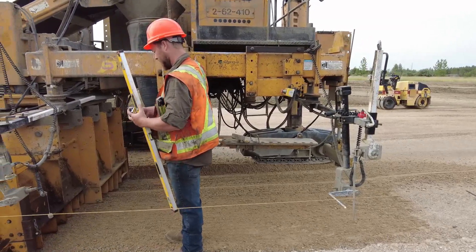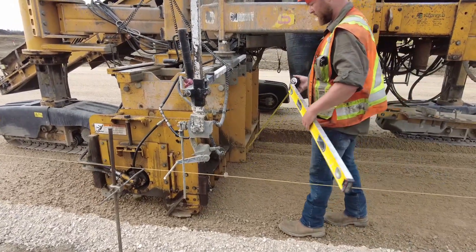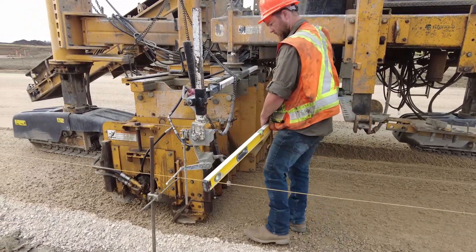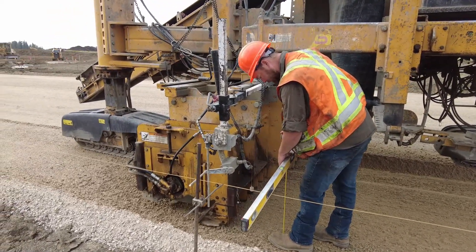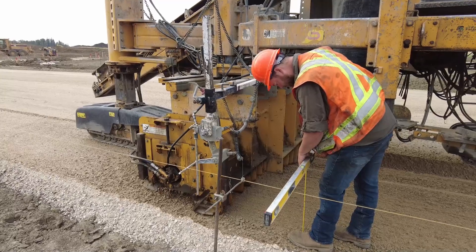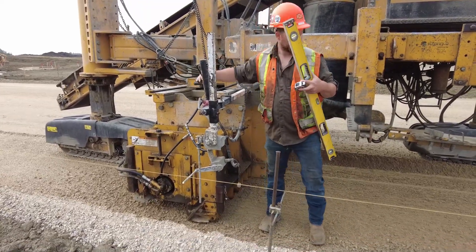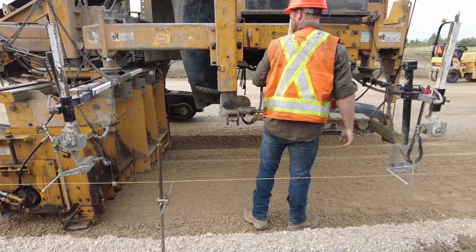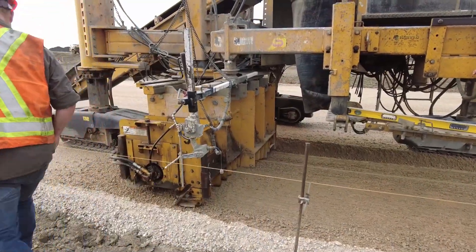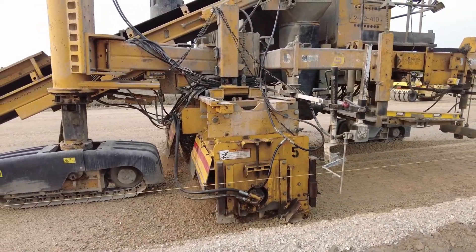That was the voice of Haley Hall. Haley kindly shot this footage for me. Here is another Gomaco operator, Kyle. Kyle is checking off the string just to make sure that everything's on grade. The Gomaco is in trim mode right now — it's not extruding concrete. It's just trimming this rolled mono and shaping it for the next step of concrete.